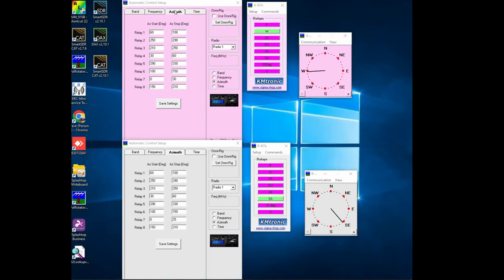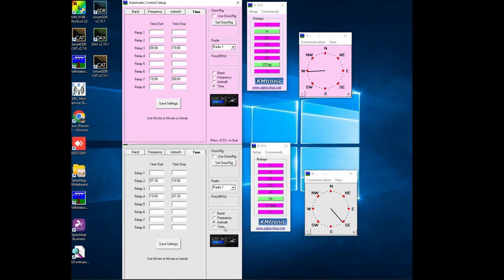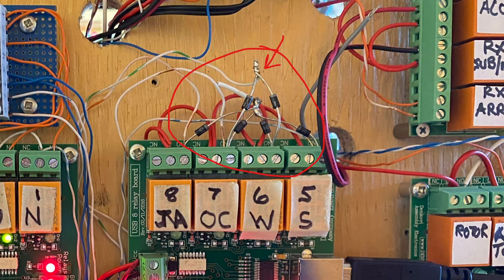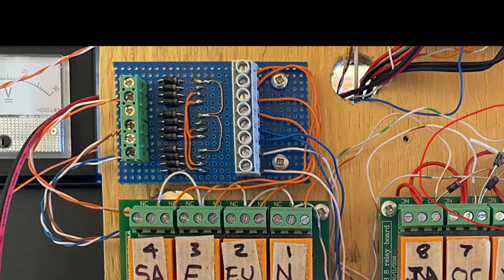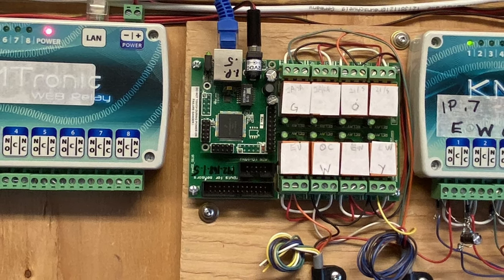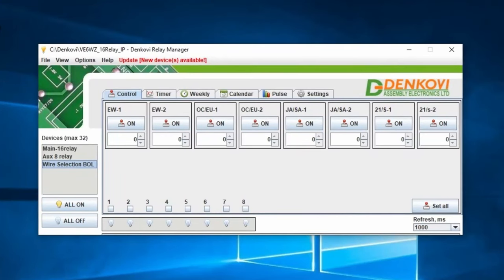Another very convenient feature of this program is you can select the relays to switch based on a time schedule. I do this for my Perseus and RBN skimmer radios, so they automatically switch from Europe to either VK or ZL or Japan at a set time, like after European sunrise. Each LAN relay box has 8 relays, so obviously 8 directions. Since only one relay will be toggled per direction, there will be times when multiple or shared external relays need to be activated. Learn how to use blocking diodes so one relay can drive multiple outside relays without conflict. The diode matrix for the 9-circle array shown here is a little more complicated. This relay board is used to drive the relays on the combiner board to isolate the individual wires in the pairs. I control it with an older Denkove interface loaded on one of the PCs at my remote.